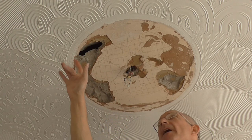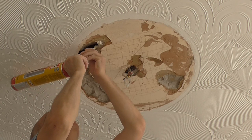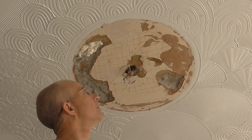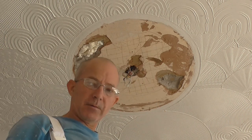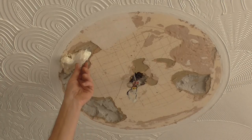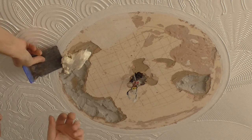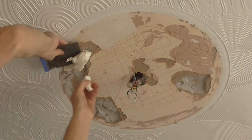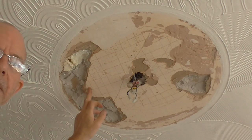There's no need to wait for that to dry - what we're going to do is put some foam in these big holes. That'll do. So that's just to fill the big void, so I've actually got a surface to put my filler against. Now I'm going to go around the room and fill any cracks or coving that's coming loose with the foam. It's dry that foam now so I'm going to cut it back.